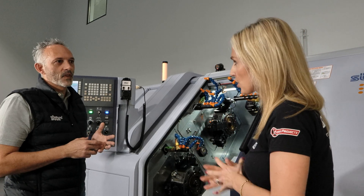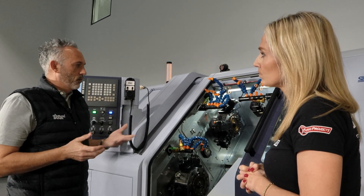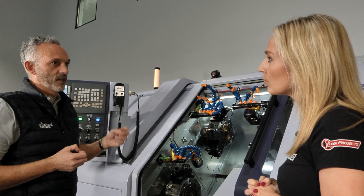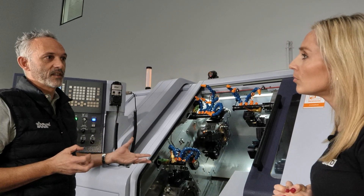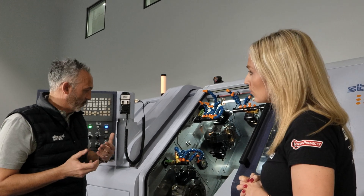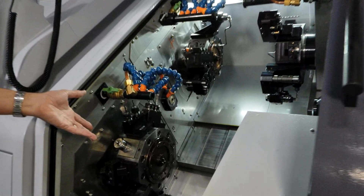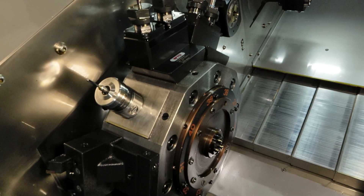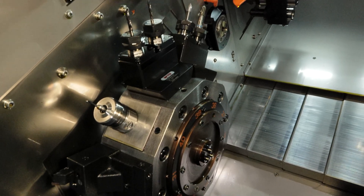So it's safe to say you look after your customer with a turnkey project. Yes — most ST machines would be purchased as a turnkey project. We've got an aerospace manufacturer where all the parts had to be set and proved prior to dispatch. We do in-process gauging on those components because they're sub-10-micron tolerances. We have a probe that can check specific dimensions as many times as needed.